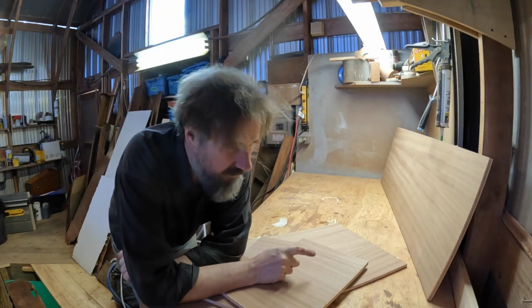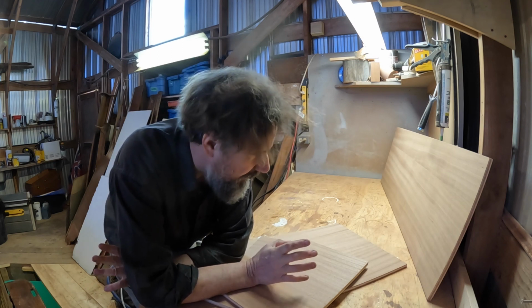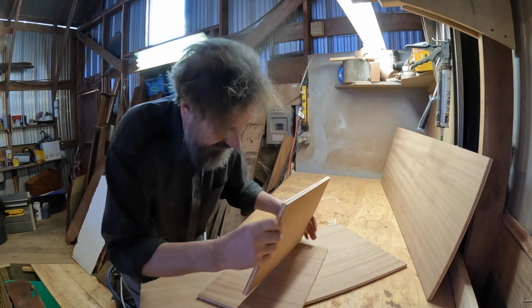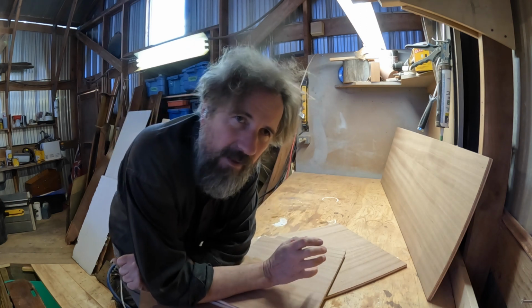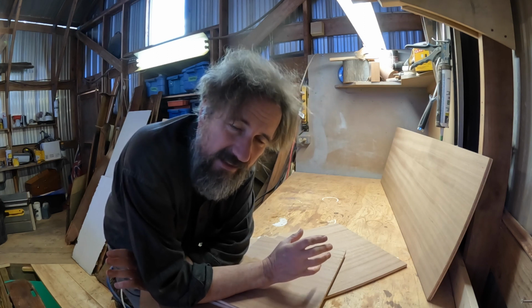Okay, so all the pieces are cut, I think. Now the trick is to assemble this all together, and this is going to be a bit of a flimsy mess. Not only that, I'm going to assemble it dry, because it's basically all panels attached thusly with screws and stuff. It will eventually be glued, but I find in something like this, if I try to glue this the first time around, it's just going to be a sticky mess everywhere.